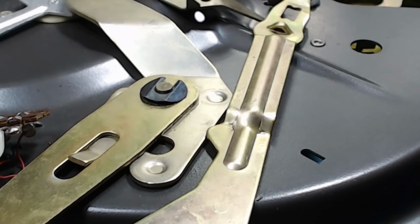I'll measure the weight of the stylus. It seems a bit high. Yeah, 7. I think this stylus is rated from 3 to 7. So I'll try and get it closer maybe to 5 or something. There's a little wheel at the back there that you adjust, and I really don't know which way to go. Oh, there it goes. So I'll measure that. It's going down.